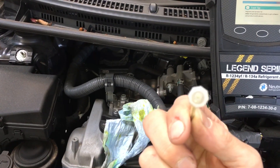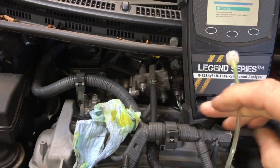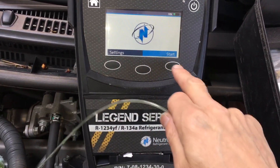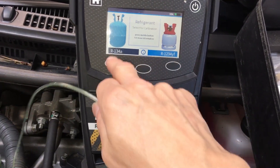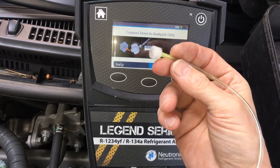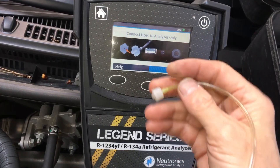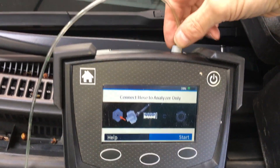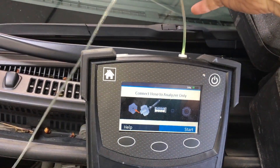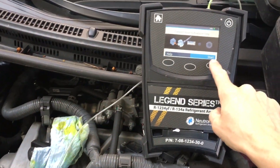They have these little plastic ends that screw on. The tool finished its warm-up. Start, select — I want R134, select. It shows a little picture; this is brain-dead simple, it's picture-guided. So connect it up, give it a little twist. It's on, connected. Start. Calibrating.